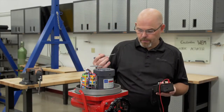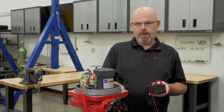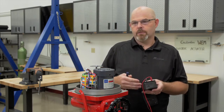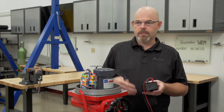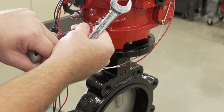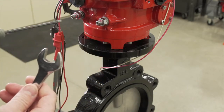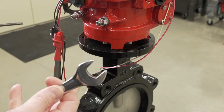One of the other problems we've come across is the hard stops. If the hard stops are not properly adjusted when the actuator is set up, or if somebody has moved them out in the field, it could cause one of two problems: it could be running up on the hard stops, which would also cause your torque switches to trip, or they could be backed too far out of the way and the actuator could over-crank past the gear. The hard stop bolts can cause problems if they're run too far in or backed out too far.